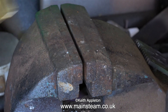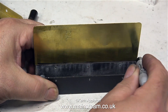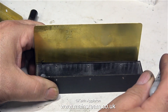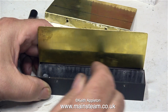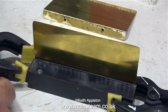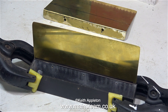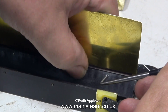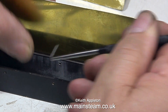Here's the job so far. You'll notice I've rounded the edges — whenever I work on sheet metal I always remove sharp edges from the guillotine process and round the edges. In this clip I'm holding the pieces of brass against the burner body and scribing another line — I'll show you why later on. The next part of the job is to mark the holes accurately on the brass to correspond with the three holes in the burner. A pair of strong spring clips are a good idea to hold it in place.